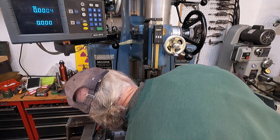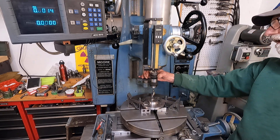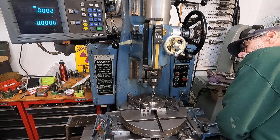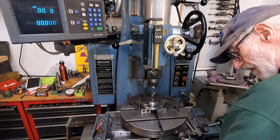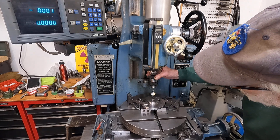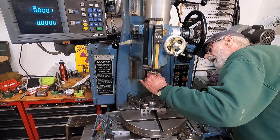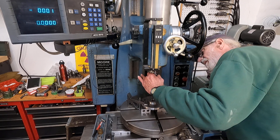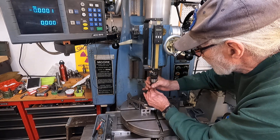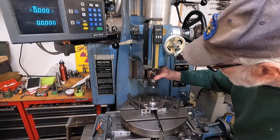A little correction on this side. I'm going to push it back — might have a slight ovalness to this hole. I'm going to lock that. Now, these are non-influencing locks; they don't affect the setting. I think that's really good. I'm very happy with that. There we go — got a keyless drill chuck there.